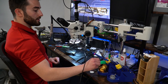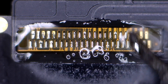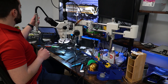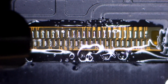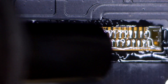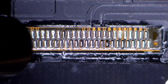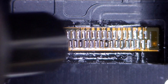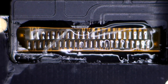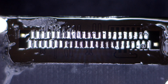I'll grab my soldering iron. I'm going to put this solder on these pads. Next we'll grab our heat gun, turn on the fume extractor, and then just apply some heat. Right now I'm at 400 degrees Celsius, 50% air flow. I'm actually going to turn up the air flow. You'll see the solder start to melt — as soon as it starts melting, that's when you start lifting. Evenly distribute the heat. This one needs a little bit more flux. And there we go, got the charging port off.